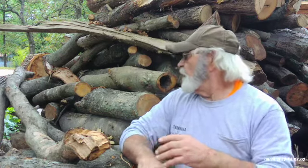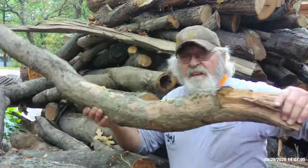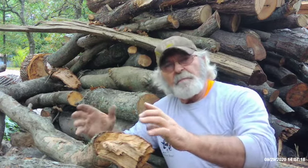Then you come around to the ones that are like this right here. If you take a look at this crooked thing, those really get to be tricky. Sometimes, very rarely, while we're sawing wood or processing pole wood, you'll see a little bit of a pinch, and invariably that's on some of this crooked wood. Whenever you get ready to put this through there, you want to make sure you've got a good grip on that wood to where it's going to go through and maintain its same plane all the way through the cut. If it shifts or twists or drops down, you're immediately putting pressure on that blade, and you're going to jump, throw your belt off, or cook your blade, get your blade a little bit warm right there in just a few seconds' time.